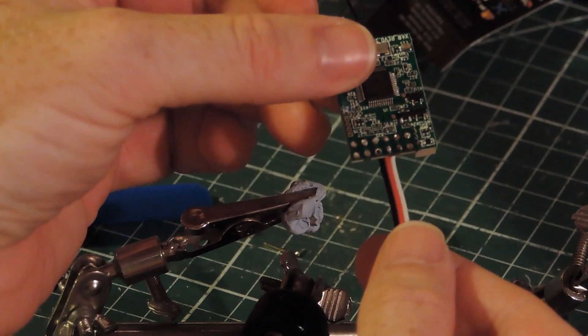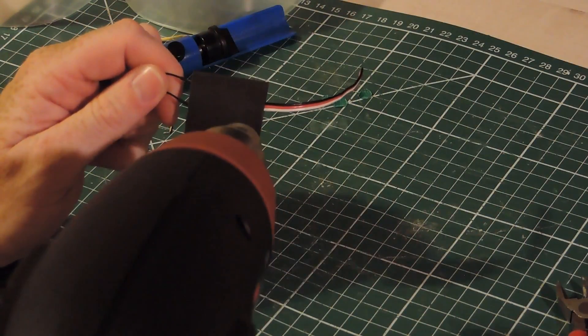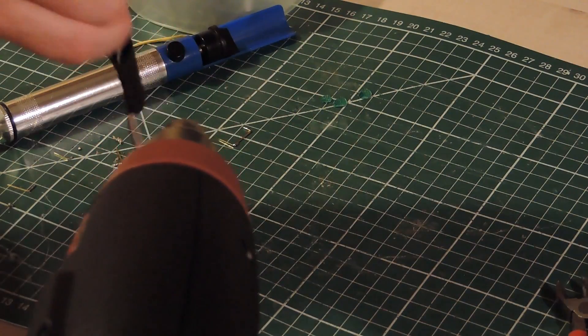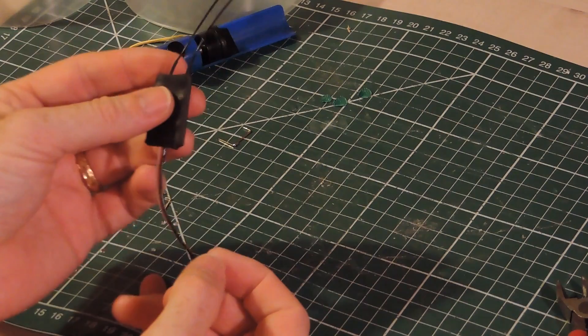That's all done — fairly happy with that. Using clear heat shrink would be an obvious advantage because then you can see the LEDs; I didn't have any, so mine's being Ninja Black. But as long as you can find the button to press, you're good. And there it is, all done, just with a nice little bit of very flexible silicon wire, which we've left no end on because that's going to have to solder straight onto a flight controller. Meanwhile, there's a link to the X4R in the description below. Obviously we've made it look a bit more like a different receiver, so you could always just get that one instead. Anyway, I'm off to go play with this now — see you later.